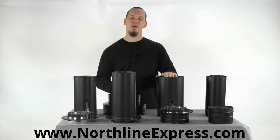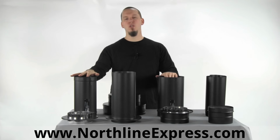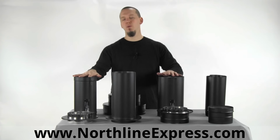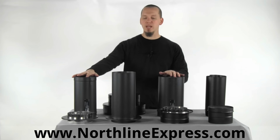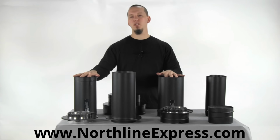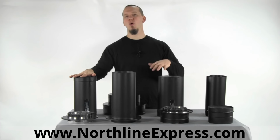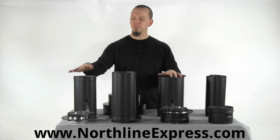In this video I wanted to take a moment to explain the different types of adapters that make the connection from your single wall or double wall stove pipe to your Class A high temperature chimney. I shot this video because it's one of the areas that creates the most confusion with that installation, and it's because a lot of people initially think that they can just run single wall pipe all the way up or out, and it doesn't work that way.